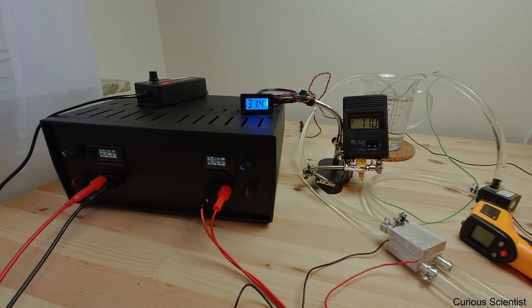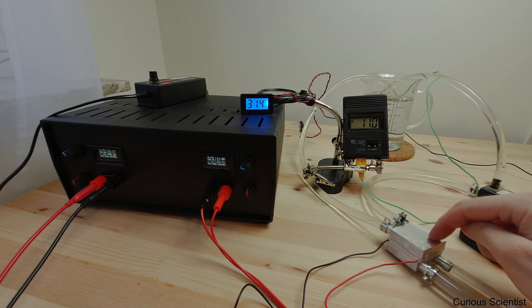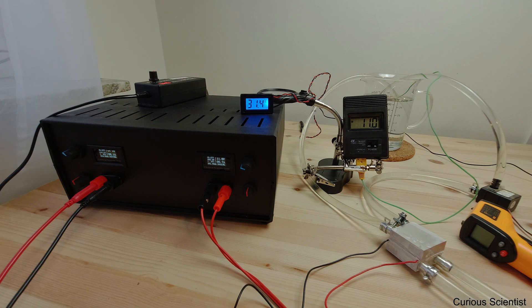As you can see it's roughly 11 degrees and it is going down but slower and slower. Since this thing is quite noisy and it annoys me, I think I will stop this experiment here. You can see that 11 degrees is quite good for drinking, but you have to wait a lot to cool down one liter of water. If you have more Peltier devices — for example 4 of them — and can provide more power, you can of course cut back the cooling time by a factor of a few, let's say factor of 3 or 4, depending on how much power you can put in.